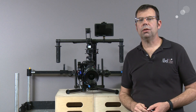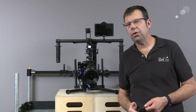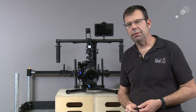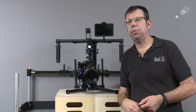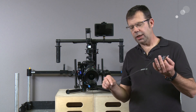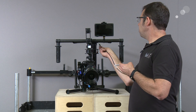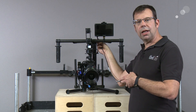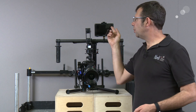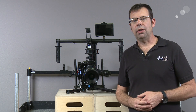For this particular build, I've opted to put the power pack off to the side of the camera, though I could have just as easily mounted it up on the crossbar of the Movi. In either case, I still have two power outputs, so I could dedicate one to a transmitter, or use a flex cable dedicated to powering up things like my TV Logic. This way, I can power all my accessories from one point and don't have to have a battery on my Movi, lightening the load.